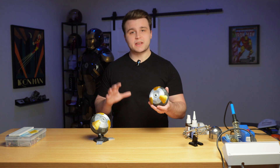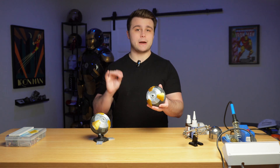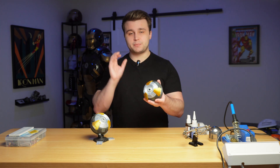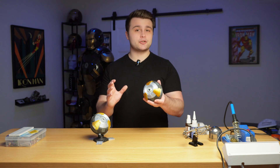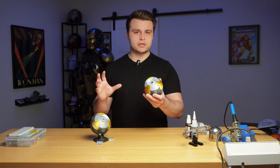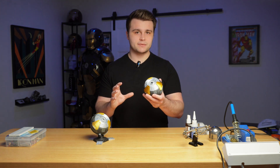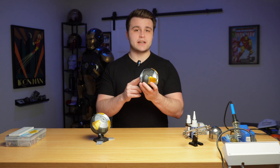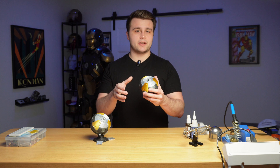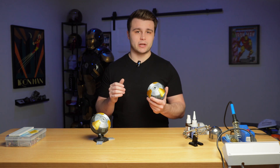For this project we're going to be using the 3D models for the Stratagem Beacon by MakerLab. The documentation by MakerLab is very thorough — it shows wiring diagrams, which files need to be printed in which colors, and how to assemble it with the required hardware. The original MakerLab Stratagem Ball was built with analog wiring diagrams: a button on the bottom to change between blue and red LEDs, a button on top as a kill switch, and it ran on simple AAA batteries.